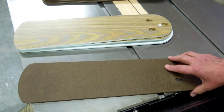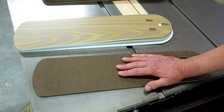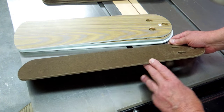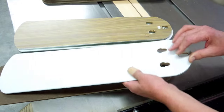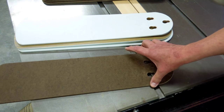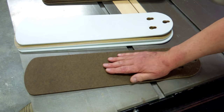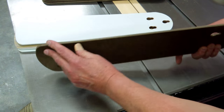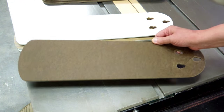So I made these out of tempered hardboard, two pieces laminated together. If contact cement will hold Formica to the top of your kitchen counter, it should hold these two together — all they're doing is spinning around. I rounded over all the edges so they'll go in and out of those holders smoothly, which is something the originals didn't do due to their sharp edges getting caught on the bracket. Tempered hardboard is coated with linseed oil and baked, so you can put it in a bucket of water and it'll have no effect whatsoever. Rounding and sanding the edges is a good idea since hardboard can be quite sharp when cut.